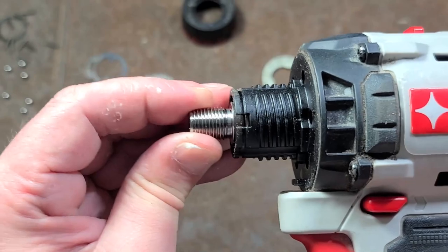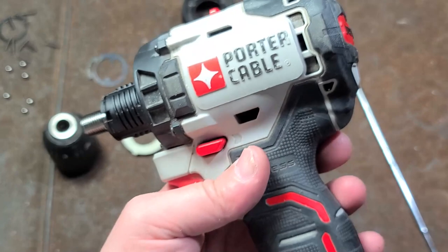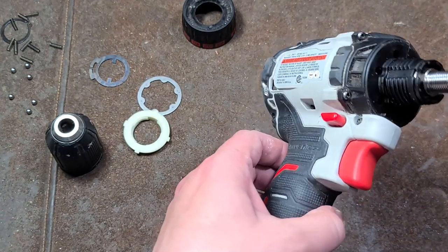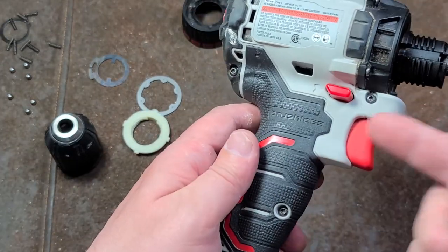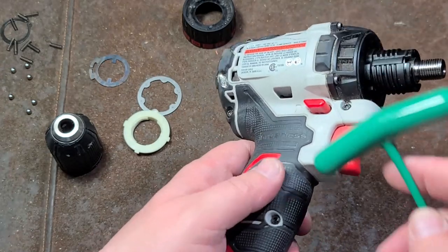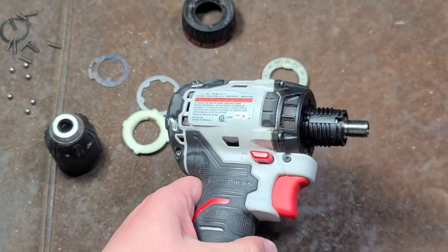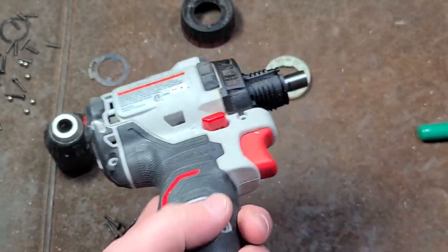This is just a real compact assembly. There's the reverse switch, and there's just no markings on what that plastic is made out of. There's the drill motor. It's known as a sensored brushless motor, and on power tools they're pretty much always like that. What that means is it's like a three-phase motor — six coils, in pairs — just turning off one pair and turning on the next to cause the permanent magnet motor to rotate, just like an old brush DC motor.